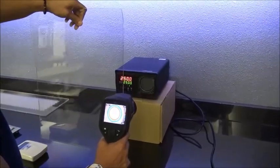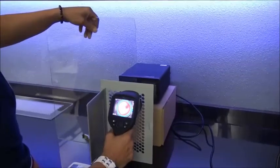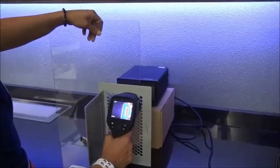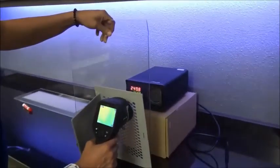So even with an Iris IR window installed in the equipment, the Lexan barrier internally would prevent a thermographer from conducting a survey of the energized points of interest inside the cabinet.